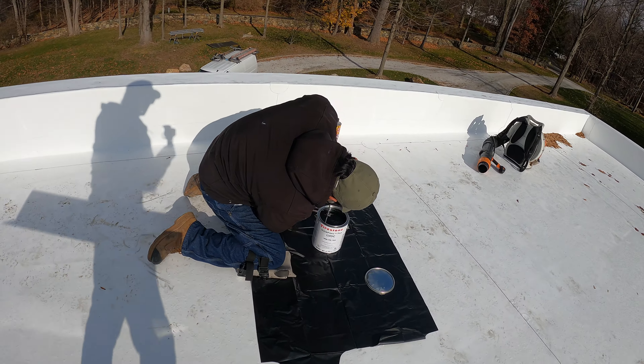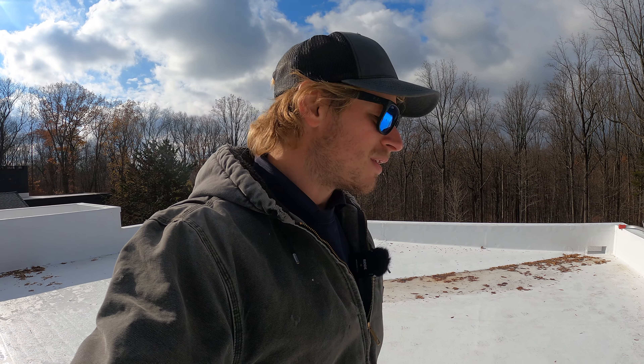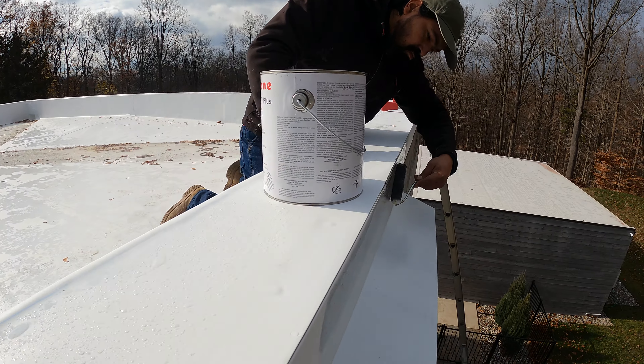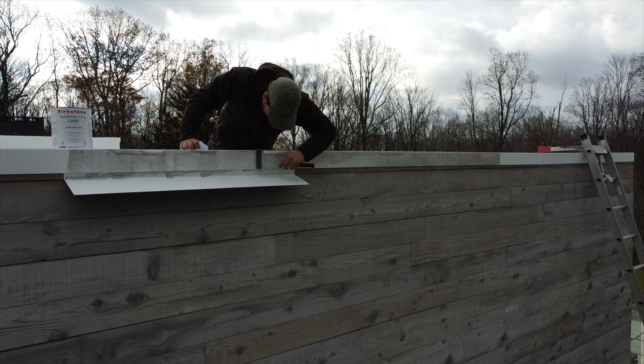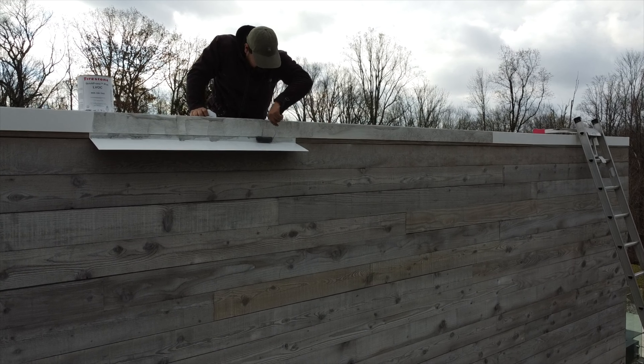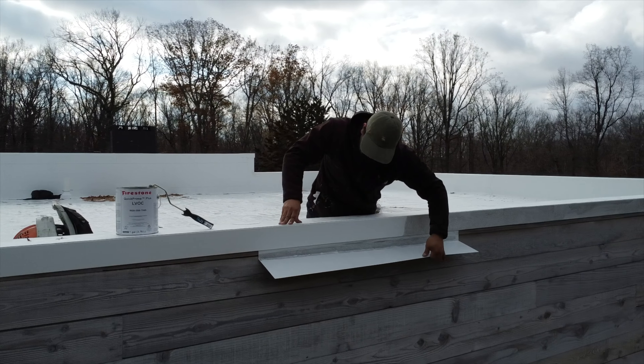So this is the idea — mixing it up and getting it ready. We're using a brand new gallon so we know we have perfect adhesion, because we don't want old product sitting around and dying on us. This is taking so much labor, time, and money to do — we need to get it right because we cannot do this again. Isaac's applying the primer right now and that's kind of what that looks like. This primer is a really high quality, my favorite low VOC single-ply primer.